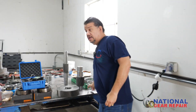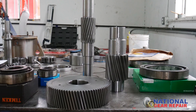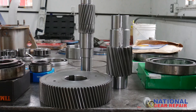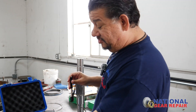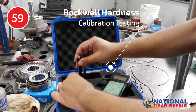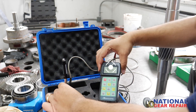If you follow me over here — our gears that National Gear Repair had manufactured just got back from heat treat. We finished grind, so we wanted to show you the hardness of our gear. Here's our calibration tester. We're going to put that on — hopefully you get a good shot on this. This should be about 59-60 Rockwell for calibration purposes. That's right at 59, so that's within spec for the calibration.